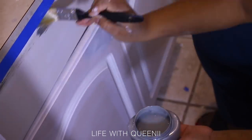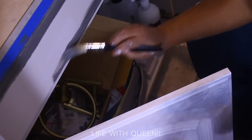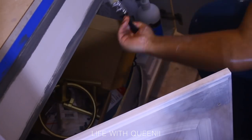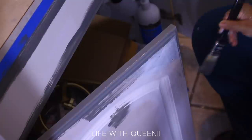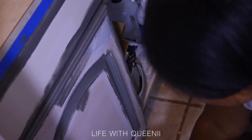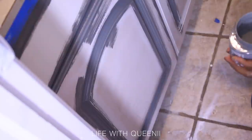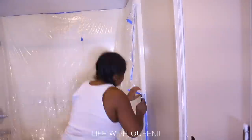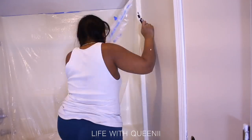Let the primer dry for about one hour before painting. The paint I'm using is a sample size — I didn't want to spend too much money on a bigger container. It's a Valspar paint in satin finish. The color is called Ocean Storm — it's a beautiful gray shade, not too cool, more of a warm neutral tone, very pretty. Use the brush to get into the molding first, then paint the rest. One sample should do a normal-size vanity if you take your time.